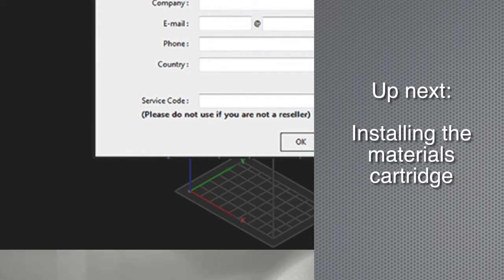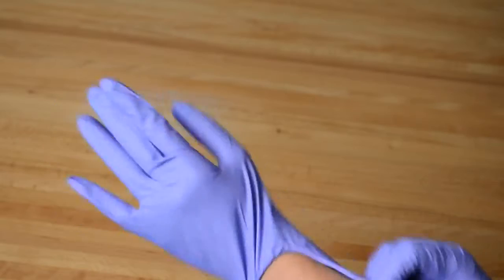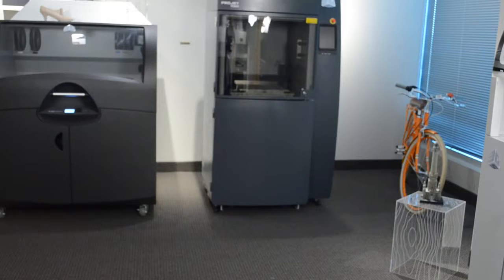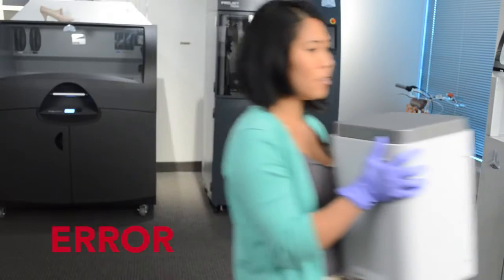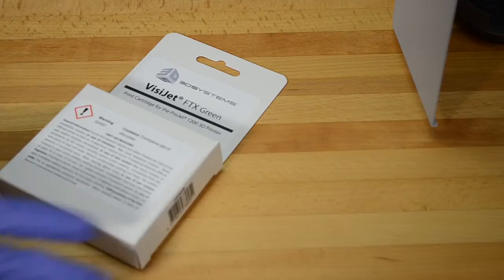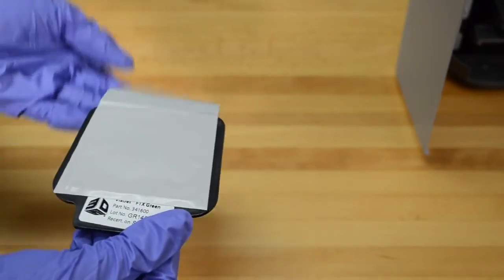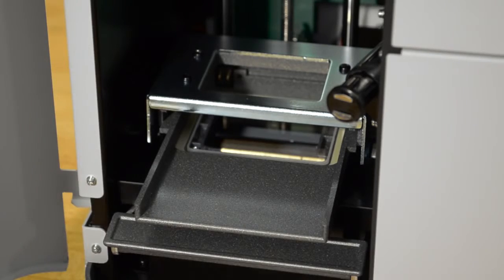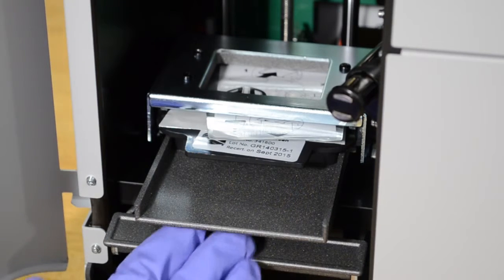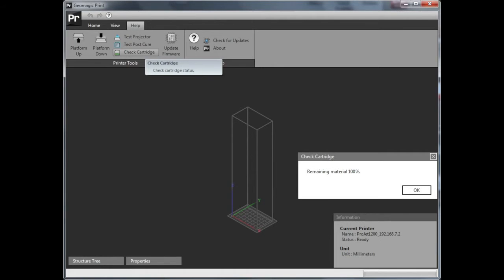The next step is to install the materials. Do not touch the materials with your bare hands — always use protective gloves and wear safety glasses. Before you add your materials, place the Project 1200 in exactly the location it will be used. Do not carry the Project 1200 around with an installed materials cartridge, as it could cause damage and leakage. Lift the material cartridge clamp lever upwards to raise the cartridge clamp, fold back the material cartridge label, insert the material cartridge into the support and under the cartridge clamp. Make sure the cartridge is seated correctly in the pocket, or a leak could occur and damage the Project 1200. Push the lever down to lower the cartridge clamp.